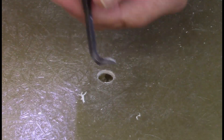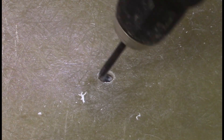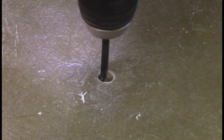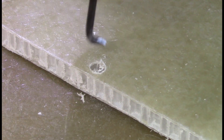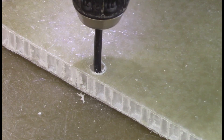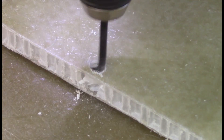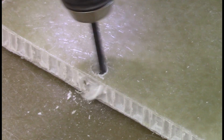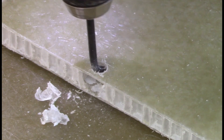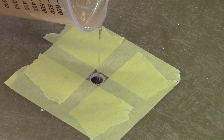If you're installing into a panel with a soft or plastic honeycombed core, take a bent nail or better still a modified allen key as shown here, and use this to gouge away at the core. Using this cut-off section we can demonstrate how this works to hollow out the plastic core. You only need the hollowed area to be approximately twice the diameter of the fitting being installed.